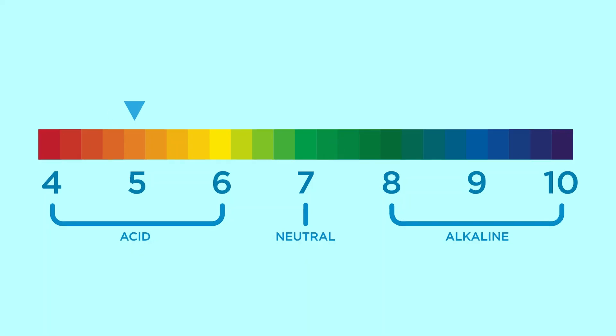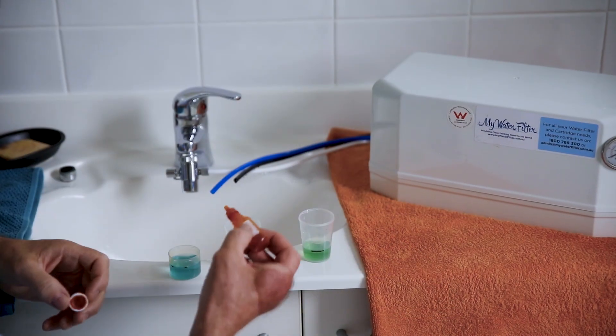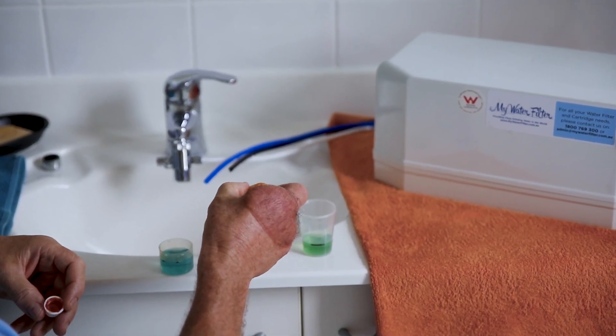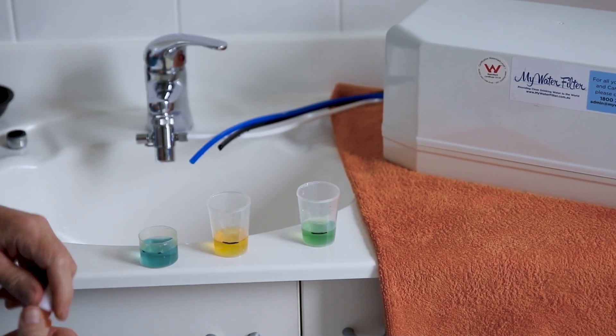After the first three stages of filtration, the pH of the water is normally down to about 6 pH. On the page below you're going to find different systems that treat the water differently after the reverse osmosis membrane filtration. The result is different minerals will be added to achieve different pH levels, to elevate the pH back to 7 or above, depending on what level of pH you prefer.